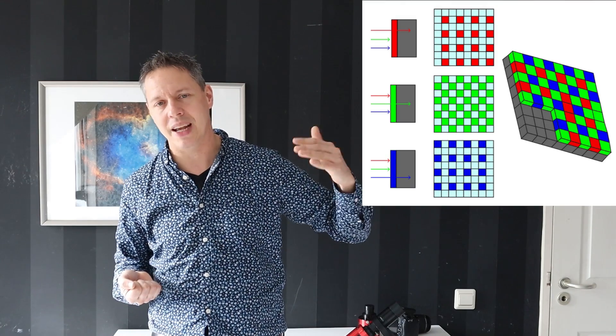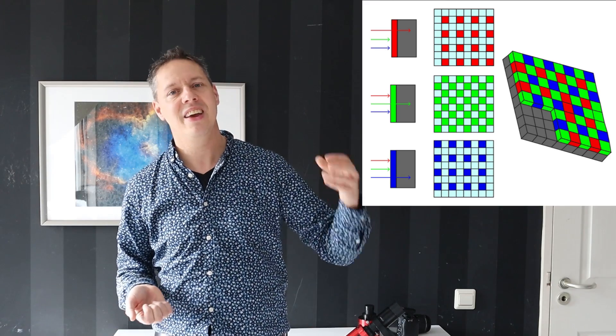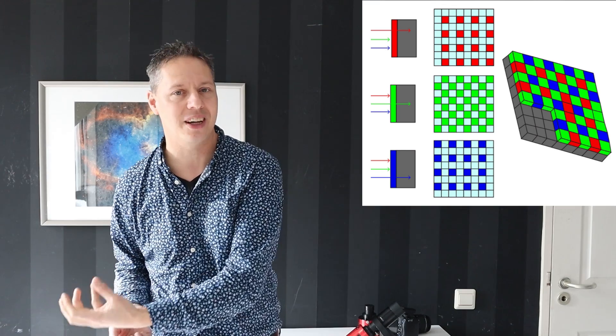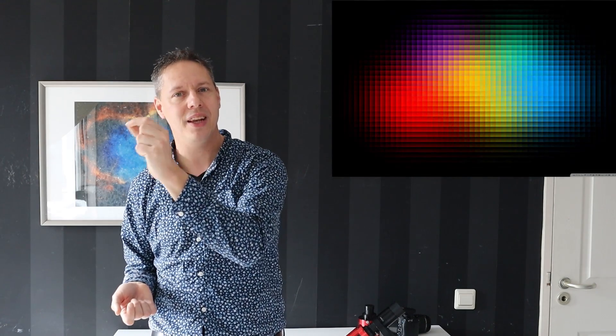So let's think this through. All of the photons from our deep sky object fall onto the camera sensor, but depending on the wavelengths at which those photons travel, they will either be registered or not. For instance, when a red photon hits a green filter of the Bayer matrix, it will not get registered. But when a red photon hits the red filter in the Bayer matrix, it will get registered. The Bayer matrix and the camera then use an automatic algorithm to combine, for instance, two green, one red, and one blue capturing well — capturing both the intensity of the photons collected and the colors detected — to produce an intensity and a color for one pixel in your digital image.